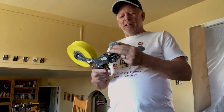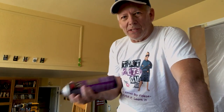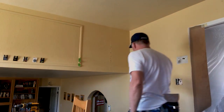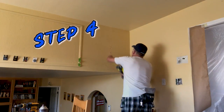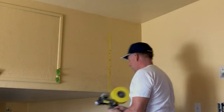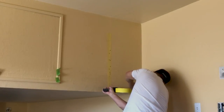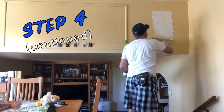I don't recommend these for the angles, but it is set up to roll into the angles — I'm not real fond of that. And then I always like to put some spray adhesive on here because mesh tape, even though it's self-adhesive, it kind of likes to fall off on its own when you're not looking. Helps it stick better and stay.